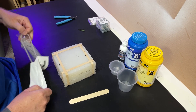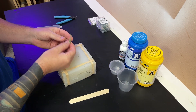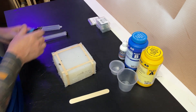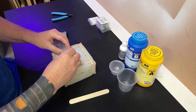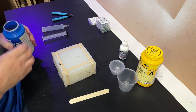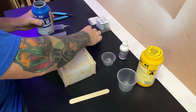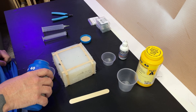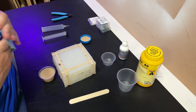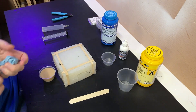Vitaflex is a urethane rubber compound and it's perfect. I chose Mold Star 20 because of its short cure time of only 30 minutes — this means I only have a pot life of about six minutes, but if I have everything prepared ahead of time it's no problem. If you're mold making for the first time, I'd recommend Mold Star 15 Slow, which has a pot life of 50 minutes and cures in four hours. Another option is the Mold Max series, with about a 40-minute pot life and typically a 24-hour cure time. I'm too impatient — if I'm making a two-part mold, a 24-hour cure time means it takes three days before I can find out if the mold even turned out viable, because just like 3D printing, the molds don't just work every time.